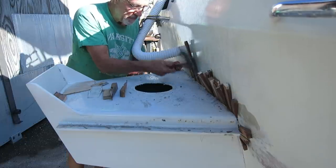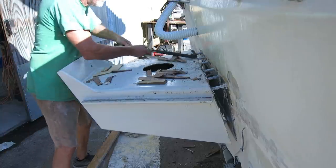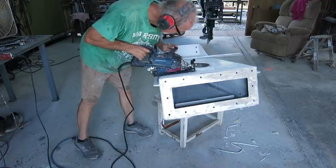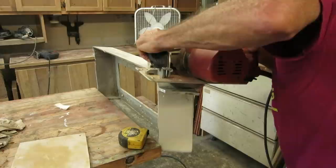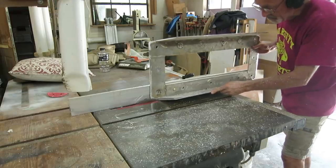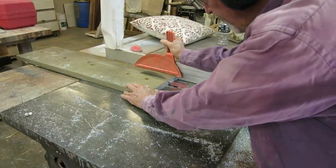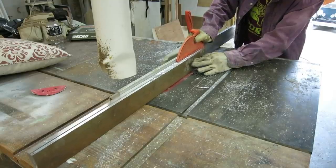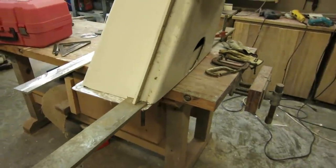In the last video I was able to get the engine pod off of the boat without doing too much damage. I cut the five inches off that I wanted to make it shorter, saved the flange, cut these little wings off, and cut the flange loose from the scrap with the table saw. I had some scrap aluminum that was too heavy so I cut it down to a manageable size and got the new aluminum rough fitted onto the pod.